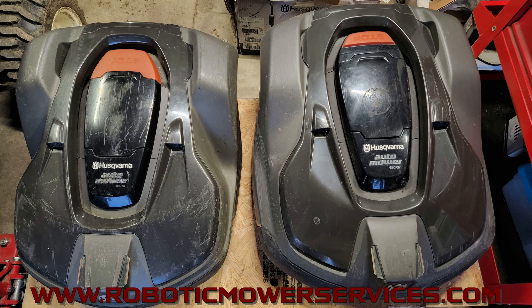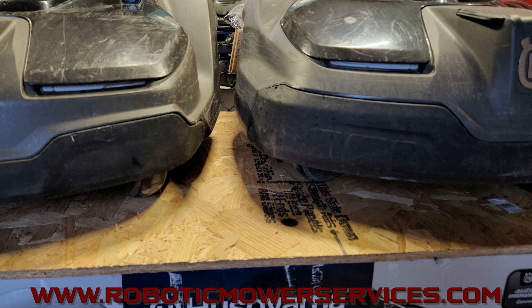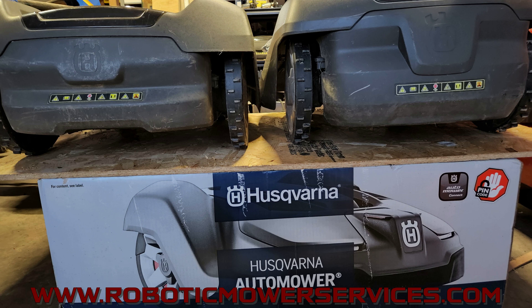On the safety side, they need the front bumper to come down to a safe level so the mower can't run over a pet, a child's foot, or any object that could cause serious injury. The bumper needs to contact an obstacle, sense the collision, and turn around. The same logic applies to the rear bumper — on the high cut mowers it comes down a bit lower, and because you have a bigger, wider shell, you need a completely different bumper that fastens correctly and keeps the collision sensor working to redirect the mower.